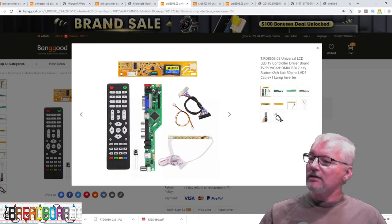This next cable is a 40-pin connector — back to that old style. This one is 6-bit again: one, two, three, ground, and clock, then a space, then one, two, three, ground, another clock, then another space. So this is also a two-channel, 6-bit LVDS data feed going to a 40-pin connector with an LED backlight, not a CCFL connector.